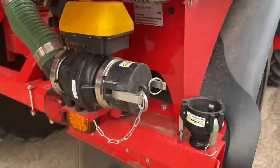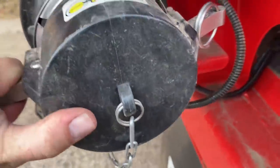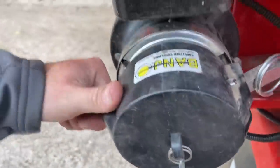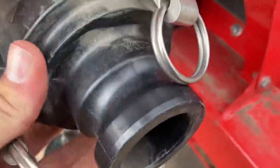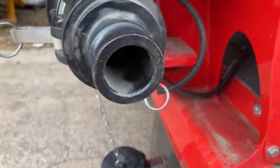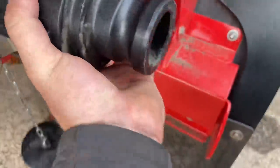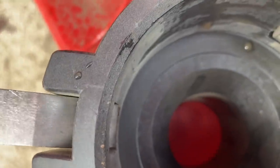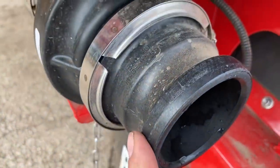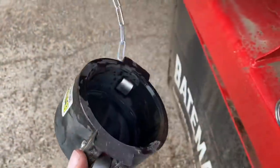This is the hydraulic fast fill pump on the sprayer. You obviously unclip this cap — which is stuck on, suction I think, because it's never been off. It's a two-handed job — there we go, it's off. Now there is a seal in that cap, so presumably there is a seal missing out of that anyway. That fits on there — now that's three-inch and it reduces down to two-inch. Then that will live on there and you clip it around with these. We call them cam couplers because like a cam in there, it locks on that ring when you flip it around. That's it locked and that's it unlocked, so the bit slides in and grips. It slides over that lip and grips in there — quite clever, made by Banjo — genuine Banjo.